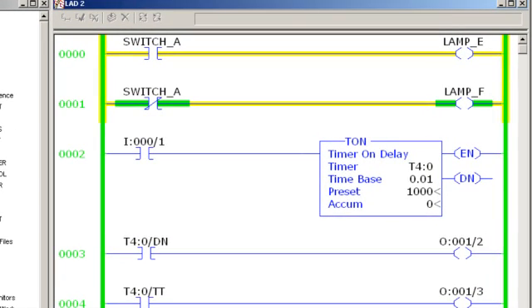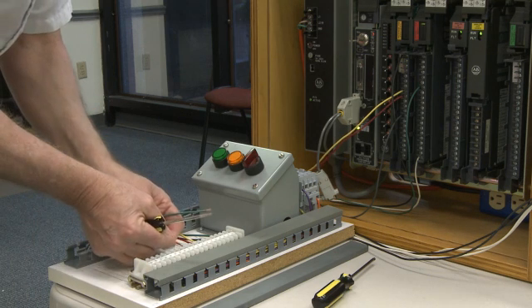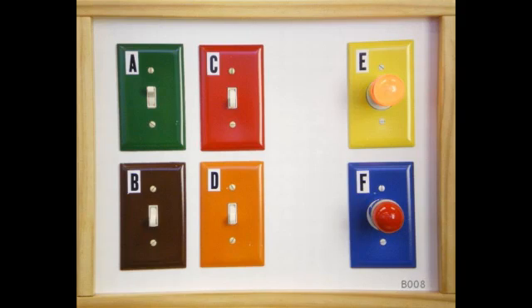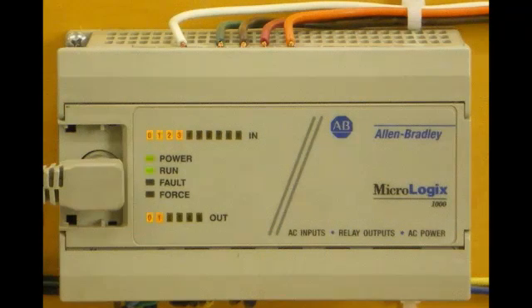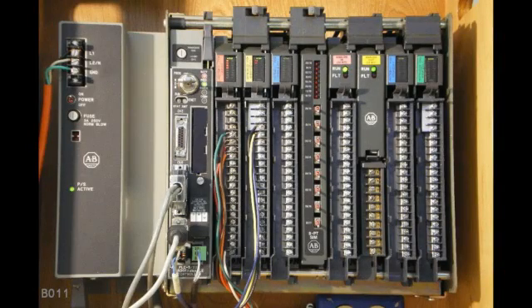Take a look at the top two rungs of the walkthrough program. The next few videos in this series will concentrate on these. When you go through the class, you'll wire up your own individual student workstation for your experiments. For our video lessons, we'll use the same simple lightbox that we introduced earlier. If you want to work through some of these exercises at home, you can use a MicroLogix system or a SLC 500 or a PLC-5 system like the one we're using today.